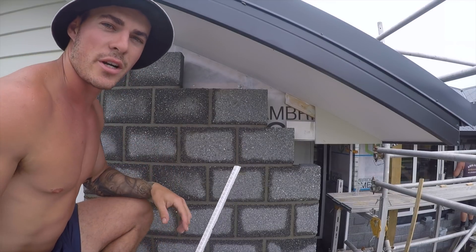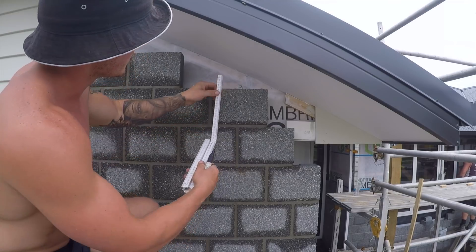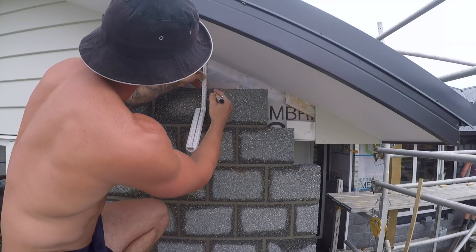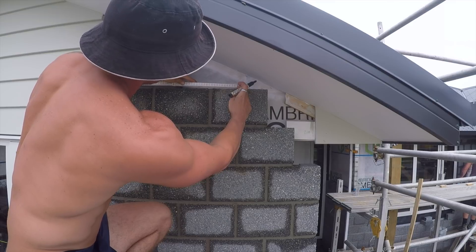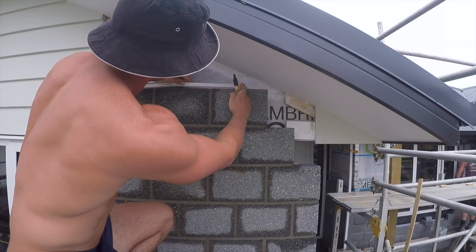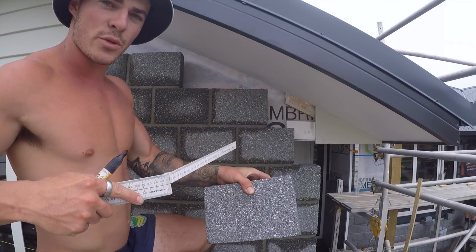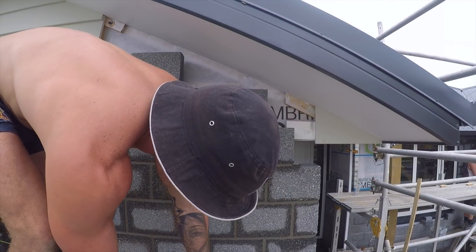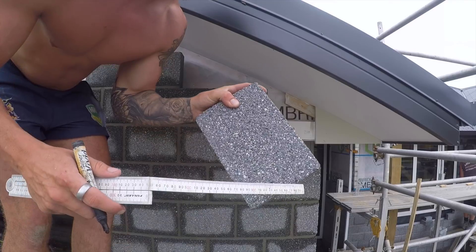If you're just doing it with a ruler, this is the way I do it. The bricks are 150mm tall plus our 10mm mortar joint, which makes it 160mm. So I come along until I've got 160mm. Mark that there. Then I measure the distance from the start of the brick to 160mm, which is 120mm. So then I measure along the top of the brick 120mm and put a mark there. So there's my mark at 120mm, and I just connect the dots — that mark there to this mark here — and that should be our angle cut.